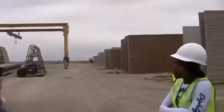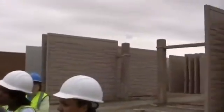That's why we have a QC department, and before any of these panels are taken out of the mold, they have to break cylinders. And they will not break those cylinders until that concrete has achieved what my structural engineer says it has to achieve. Usually it's 3,500 PSI. And the stresses at the time when you strip it would be 50% of that, or more, or less? It's very close to capacity. Complete. So not the 28 days thing.